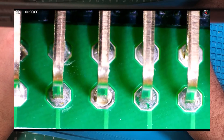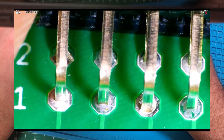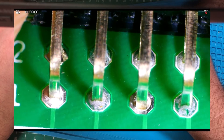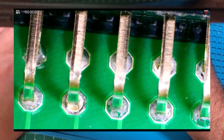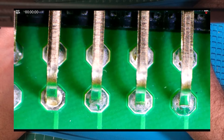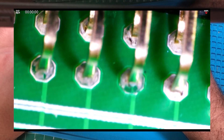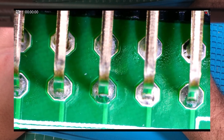Finally looking at the Uz Husky — you can see some missing depth in several spots. It's not as good a penetration as the Kester. Where it did go through, it looks bumpier — the solder appears to have cooled down too quickly, so it does not look as smooth on the underside of the board. Overall, not being sponsored by Kester or anything, I really do like that Kester 63/37 from Amazon. Beyond just the feel, I think it actually did a better job, even considering my crappy soldering. Hope you have a great day, thanks for watching.